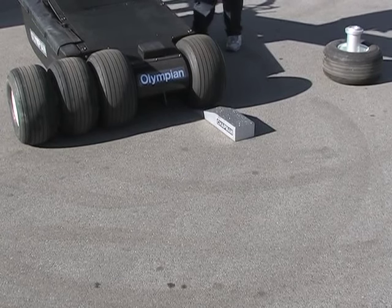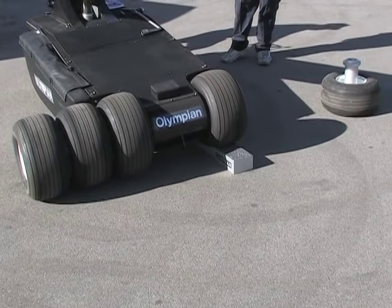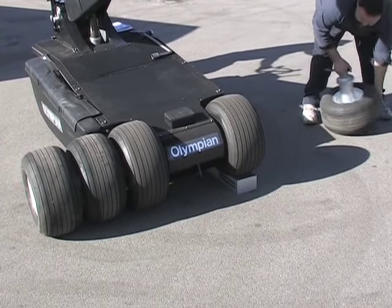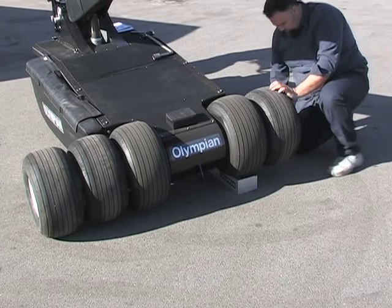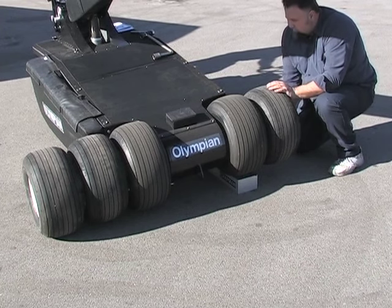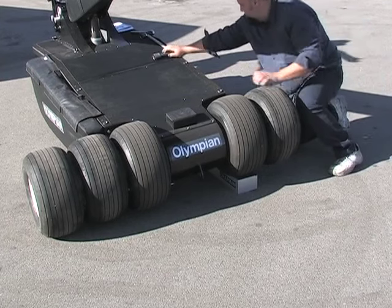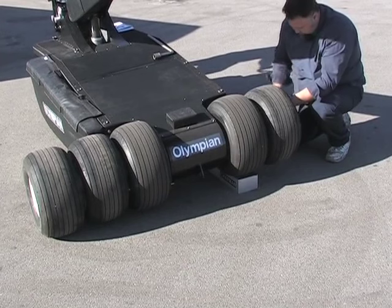Let's go up on the ramp. Now we'll do a single tire on that side — we're just showing you how you can put two tires on or one. Then again, lining up the lug nuts, get the wheel to seat in. It's usually a good idea to put a little grease on the cone and on the threads. This can be operated with one tire per side or two on each side. As long as you're at 48 inches where the platform is, you're plenty stable. Some stadiums don't have much room — guys have run three on one side, two on another.